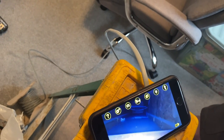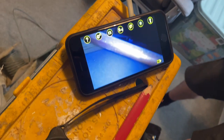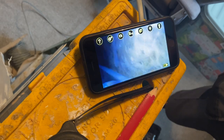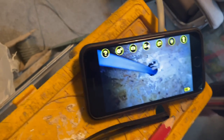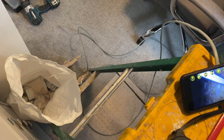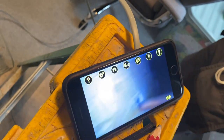That's horrible - don't like that gas running in the property, it's horrid isn't it? There's the pendant - James is going to put a rod up. This is the gas pipe we've got to avoid. The cable's going to settle on the plasterboard and then run to that point there. Battery's good - she's got three bars. There's the hole - we can fish through the pre-made hole in the timber and there's one the other side as well. He's only got 1.25 in. We might want to use a bendy one - use that, it should be all right. Red is like middle bendiness - go on then.